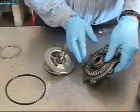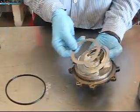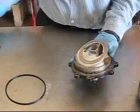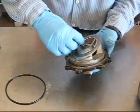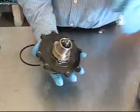For reassembly, keep track of your parts — make sure they all go back in the right spot. This shim sits right on the back side; it can fall off and you can't figure out where it went — that's where it goes. Put a little oil underneath it so it sticks on there nicely. Make sure it rotates. Ready to assemble.